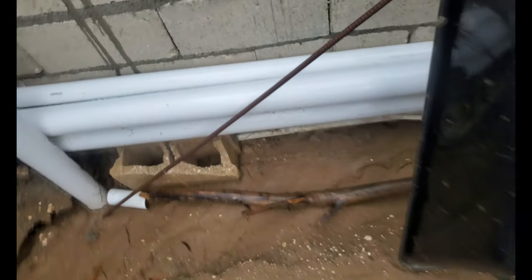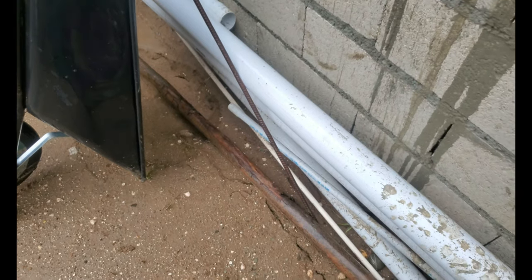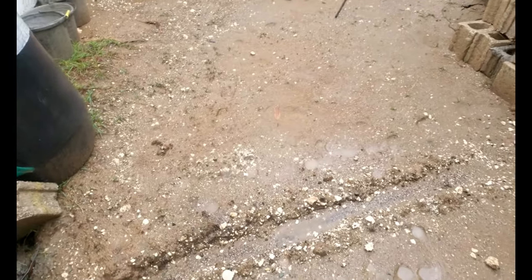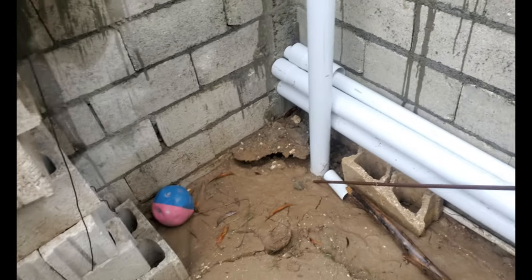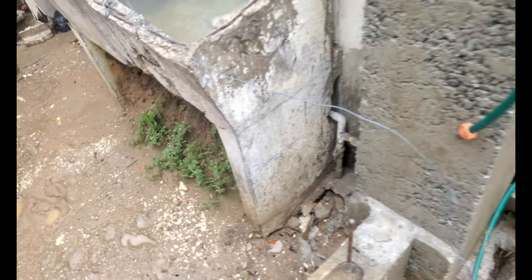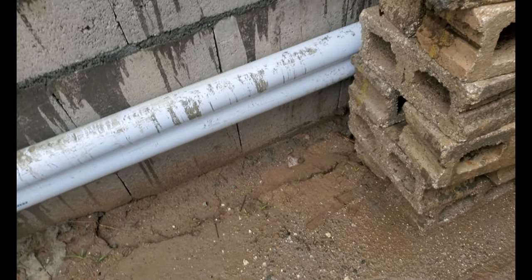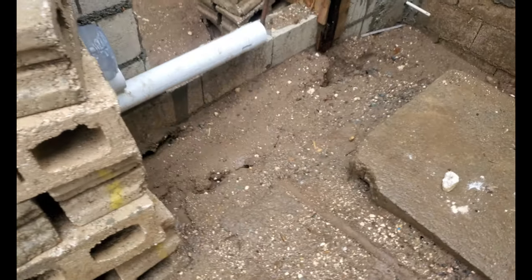And pack down all of the loose dirt. So now we can't throw back in anything in there until the dirt gets hard. Why don't the corners pack down? Because nobody is walking in the corners. People walk in the middle, so the middle gets packed down and the corners don't. So the rain actually packs down the corners. When it's dry, you just throw back some more dirt and backfill some more.